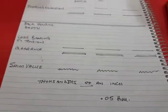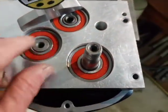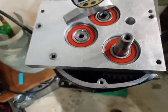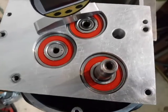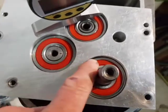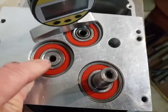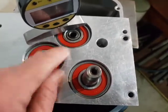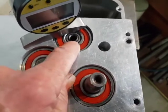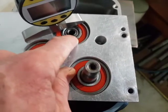And even then, when you put the whole thing together, you put some grease on the top of these bearings and stick your shims to them along with your baffle plate on this one, after you've taken this plate off. Heat the housing up, drop it on the back and tap it down. And you can find you've got a tight input shaft, or that the shims won't move around in under here — they're stuck and this is tight. The only way you can check it is if this one is free and has the right amount of end float. You're aiming for as little end float as you can get — around two to three, four thou. They say five.